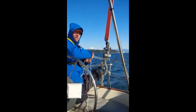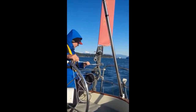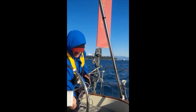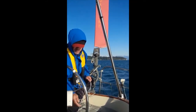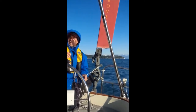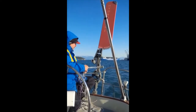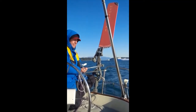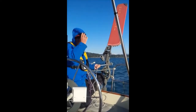So right now I'm going to bring this around and adjust it for the tack that we're on, approximately - that's about right there. I've got the bottom pin out, the top one still in. Now I'm going to shut off the wheel pilot. It's actually steering me downwind a bit, so I'm just going to center it for now, center the wheel, pull the pin, and now we are steering under wind vane. She's heading up so I've got to head down. Let's just let her settle in.